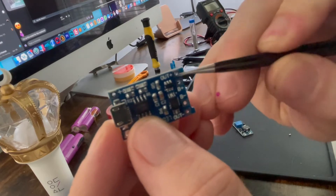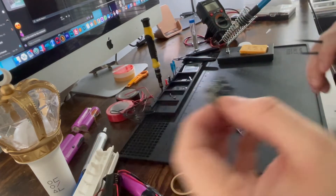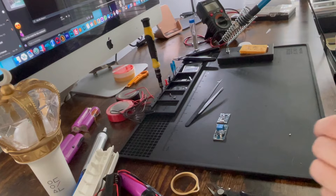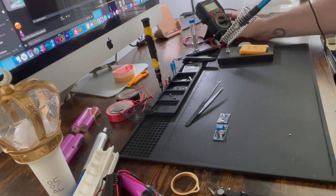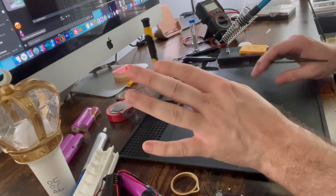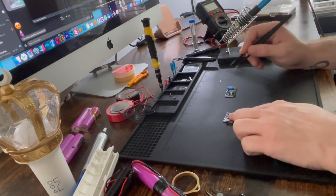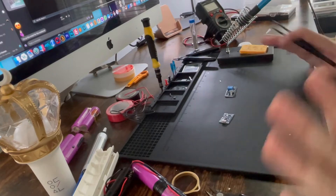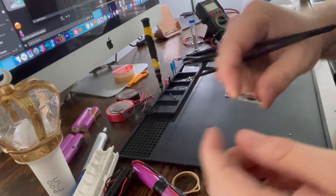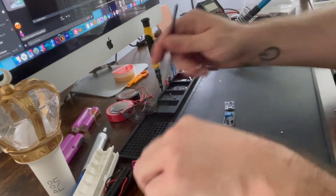These connections here are the actual battery charging inputs and outputs on the TP4056. Once you have that connected, check your solder joints — I was really glad I had the multimeter to verify my connections. Once the battery is connected you can start charging it. At that point it has nothing to do with the lightstick yet, but you can take a couple of 18650 batteries, connect them directly to this as its own thing, and it'll just keep charging because you can plug a USB right in here.